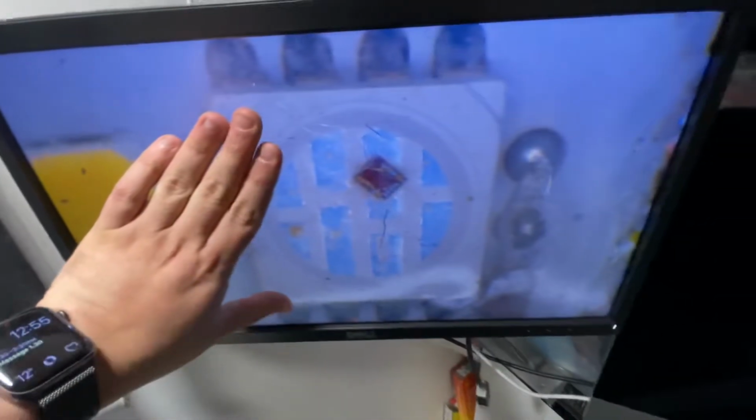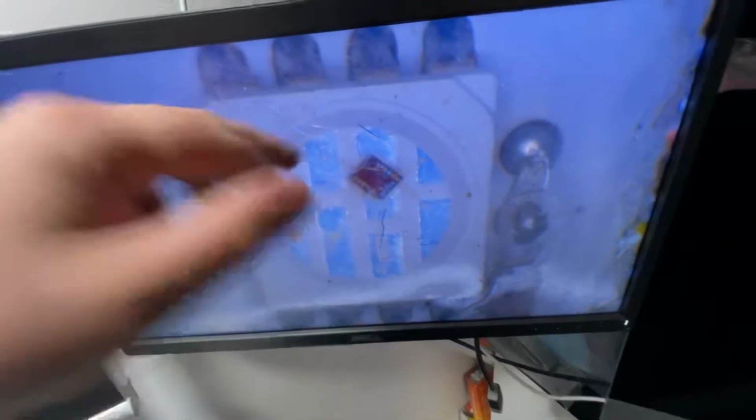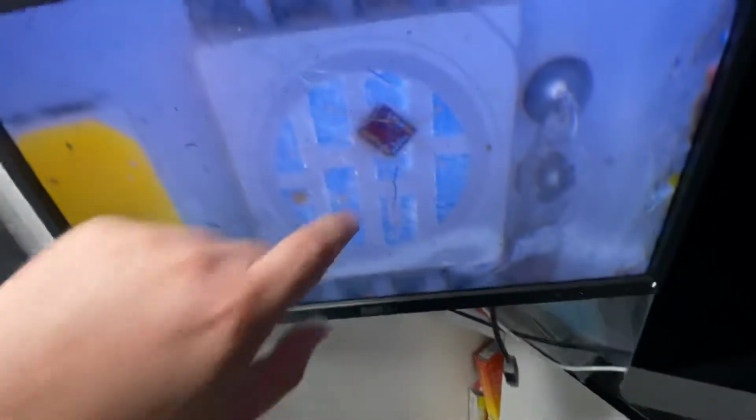Then the next 6 down, we have another one of these. This gets a different ID number, so it will look for what it's supposed to be. It might be getting ID'd as, say, I don't know, chip 12. Chip 12 becomes green. It says, all right, I need to become green. Lights up the segments it needs to be green. And the next 5 after this, so a total of 6, would be green.